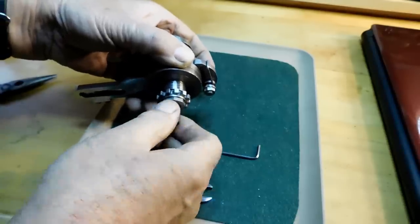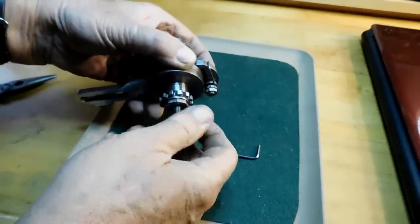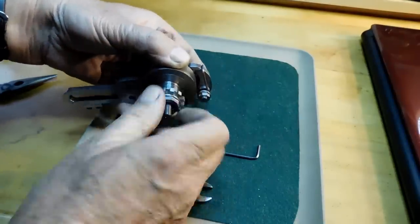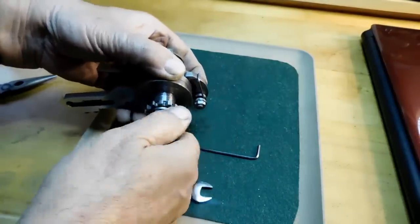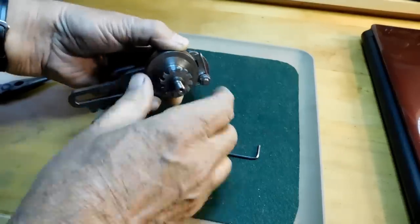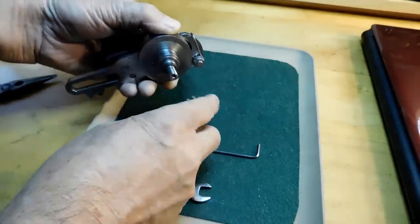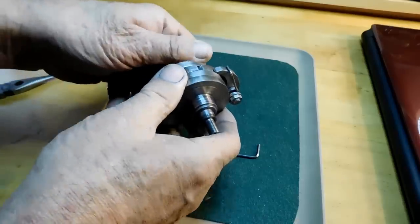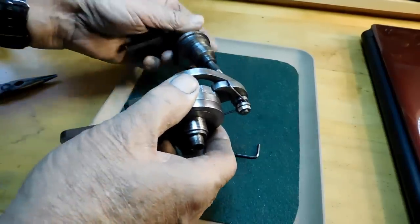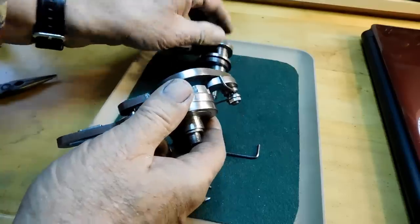I had to cut it on the lathe because I didn't have a die for it. So I think if I was to do it again, I might find a comparable die. And this is 40 TPI as well, this nut here. And it holds the blank on. And this thing holds the indexing sleeve, which should slip right off now. There's your main mandrel.